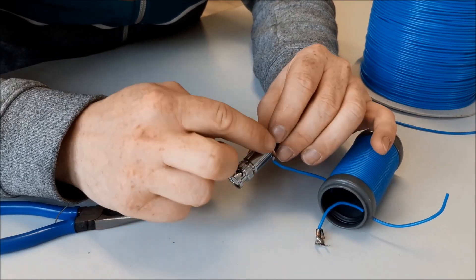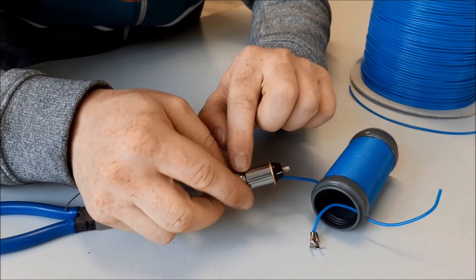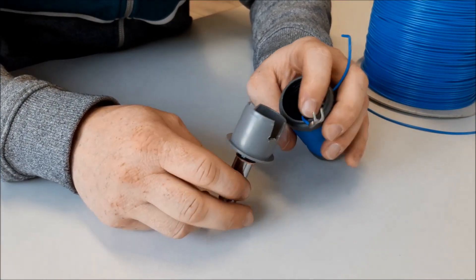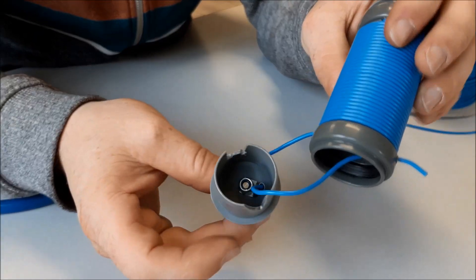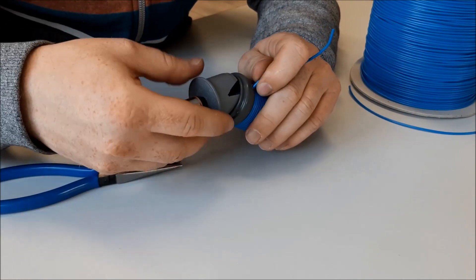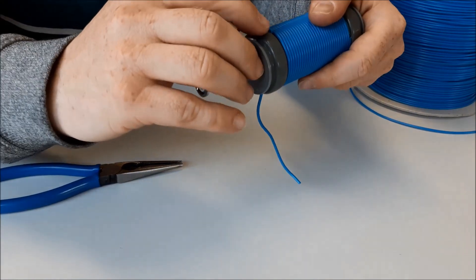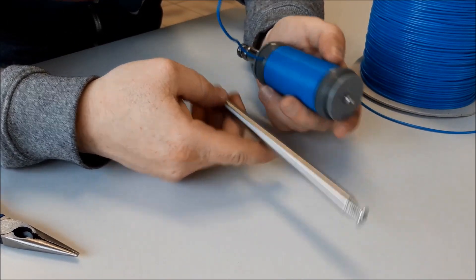The coupling is connected with the outer of the BNC connector and the internal goes straight in there to this M5 thread. Now we have to push that in there. Now push it in there — okay, now you can mount this telescopic whip.